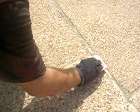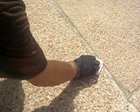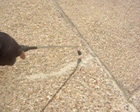It's got a little bit of red in it, just a little bit, and I use this on exposed aggregate. And you don't have to pack it in real hard or anything. The fine particles will fit down in there. I spread it out just a little bit, and all you're doing is spraying it with a fine mist. Make sure there's a little bit on the surface area on either side.